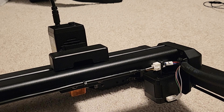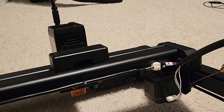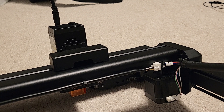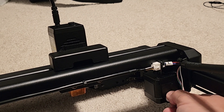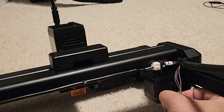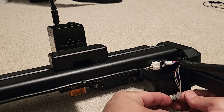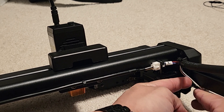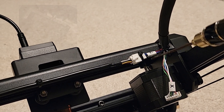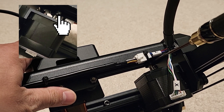If we're not able to get to those screws, we're going to have to take this whole bracket off, which is a little more involved. So the first thing you want to do is go ahead and disconnect the X-axis stepper.